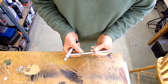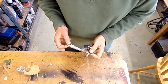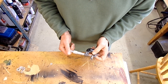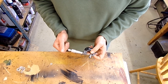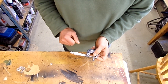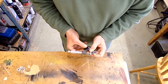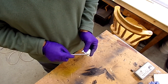I've got the stainless steel pipe here. I just want to check the external diameter to know what we've got to get through. That is 9.54mm. So I can drill that to 9.3mm — I've got a 9.3mm drill bit — then I'll have to try and borrow a machine reamer to ream out the holes. I drilled this out to 9.3mm.